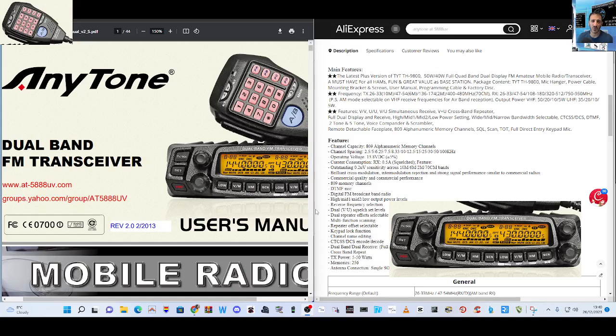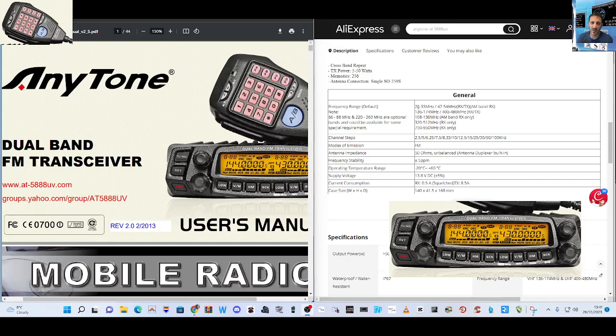The lowest power level is 5 watts. DTMF is what we need. When it comes to receivers, it does do AM so we can listen to the air bands — and probably marine bands as well, and PMR. In America, GMRS. Looking at the frequencies listed: 108 to 136 MHz AM receive only, and TX is 400 to 480 MHz, so I'm sure that covers GMRS and definitely covers PMR.